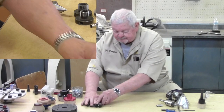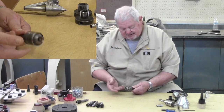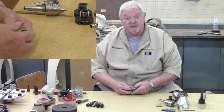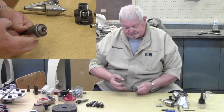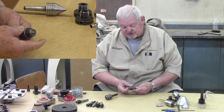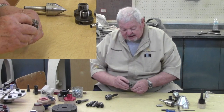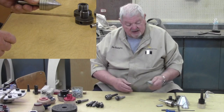That covers what powers the wood on the lathe. Let's look at what holds it on the other end. The most common type of live center has a point — many of which are removable — but when these get tapped out of the lathe, the point can come out and go flying into the sawdust, never to be seen again. This was the one that comes with most inexpensive lathes. We buy a lot of these aftermarket ones as well — they're also live centers and spin, less expensive. Because we lose so many centers here at the studio, we have a number of these to replace. The point centers with a cup keeps it from digging into the wood too far. We use a lot of this one.